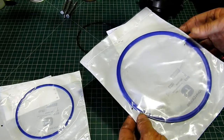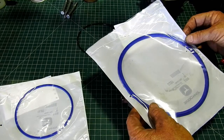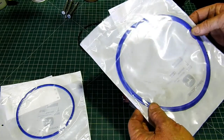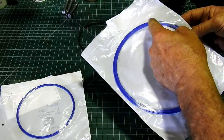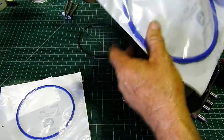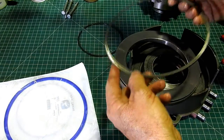And look, it is. But the problem is, when you're doing hard hydraulic work with the tractor, and there's another problem somewhere, the oil gets really hot. And when the oil gets really hot, sometimes these get overcooked and they go a browny colour and they just crumble, they fall apart. So for this to have that piston ring in it, guess what Lance is using? This.